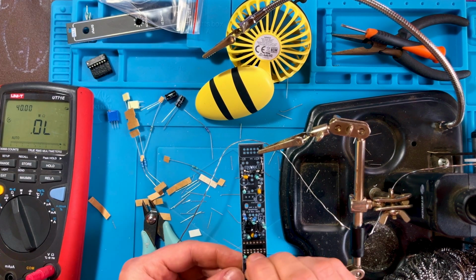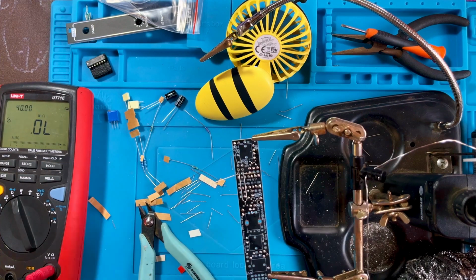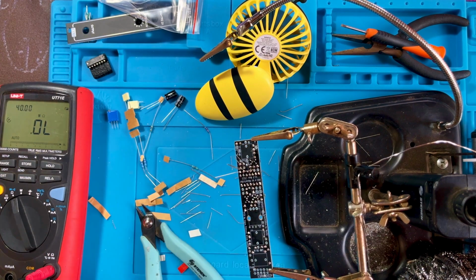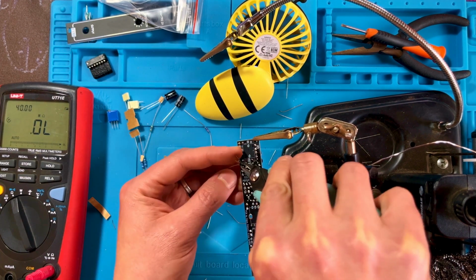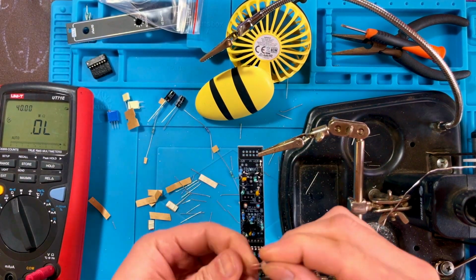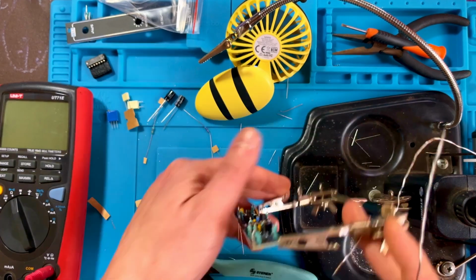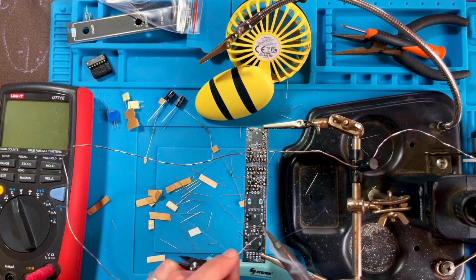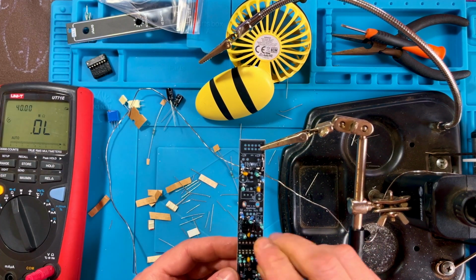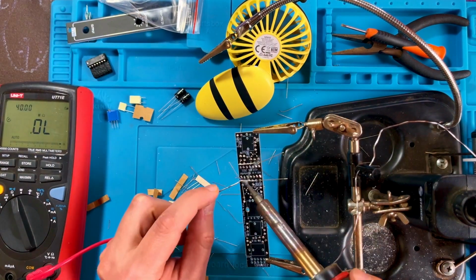Now you might notice sometimes if it looks easy, I'll solder the exposed pins on these resistors from the top side, and that'll save me having to fold out the legs from the bottom, because it'll keep them in place. I think that's what I'll do with these two. Let's check it out. Yeah, see, I'm soldering that exposed pin, and that way I can just turn it around and they won't fall off. And solder the remaining pins, trim the leads, turn it back around, and yeah, just do that till you're done with all of the resistors. Okay.